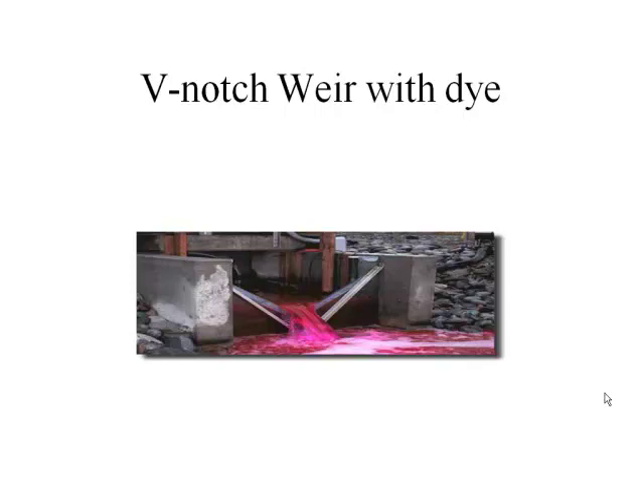The city has become aware of it, and what they're doing is conducting dye tests to see who is properly connected and who isn't. This could have been just a bad job done by a plumber or someone cutting corners. The inspectors would go put dye in the toilet, shower, or bathtub and wait to see where it comes out. If it does come out in the storm sewer, they would have an appropriate colour for each home and could figure out where the effluent was coming from and order those people to have everything fixed.